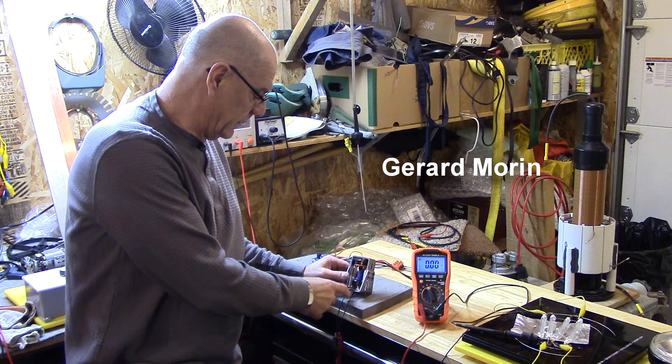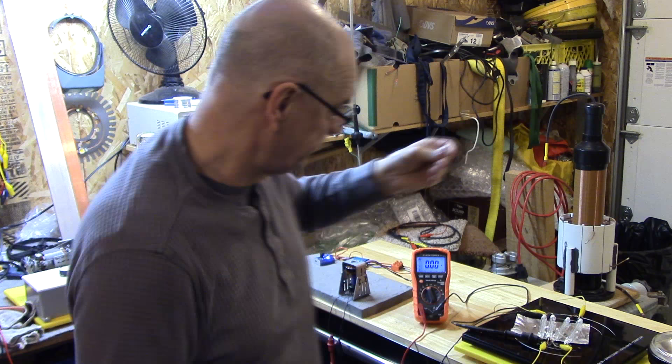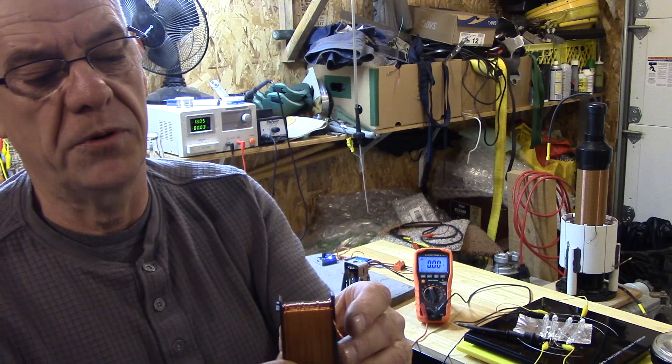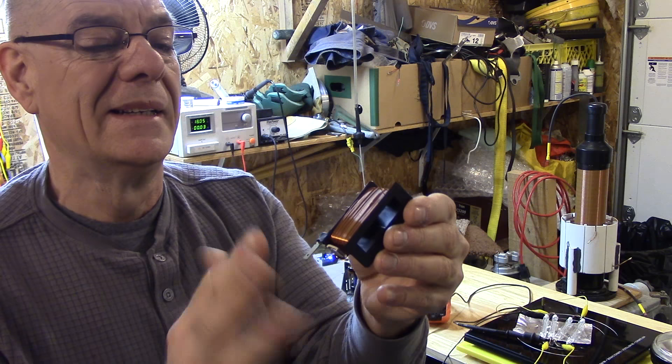So I'll show you — I think I got some wire here. This is more likely the wire that was in it. That's the full length of the coil, one meter exactly, and it's a multi-stranded wire. So what I did is I replaced the wire with a single-stranded wire. The wire I used — I took one of those coils from one of my pumps that was not damaged, and I was stealing the wire from it. So it's perfect. I believe the size of the wire on that one is maybe 25, could be 24, so I'm not too sure.